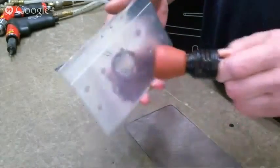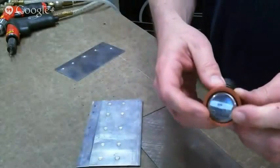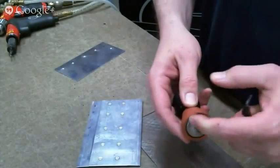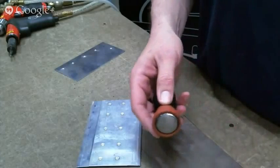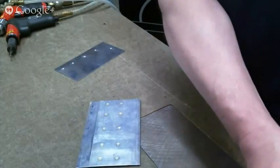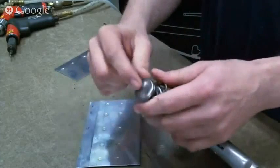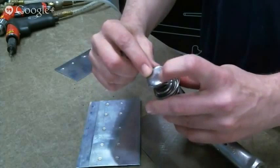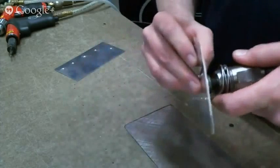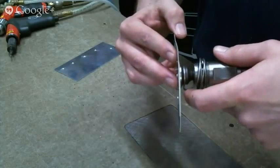The second one is you put it down over the rivet, and you can't see where you're at anymore. So to combat that, they made this very flat. So instead of having a true mushroom, it's very flat across the face. So you're beating on your airplane in roughly an inch of diameter here. Where if you use a regular mushroom set, I'm just going to leave this in the gun. If you use a solid mushroom set like this, it's domed, so you're only really hitting an area that is about 3/8 of an inch, 1/4 to 3/8 of an inch in diameter. Plus, you have the advantage of being able to look down between the set and the aluminum and see that you're right on top of that rivet.